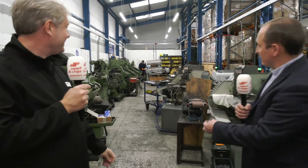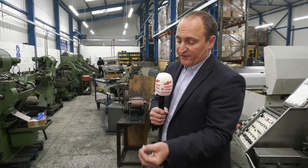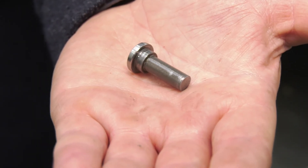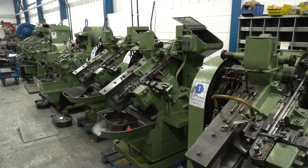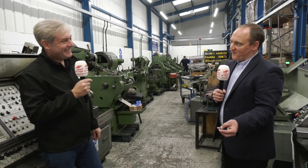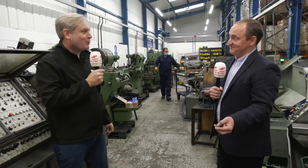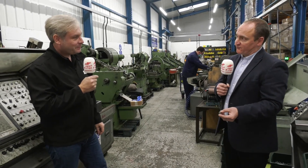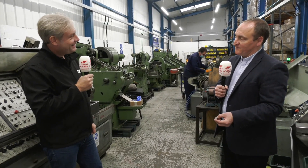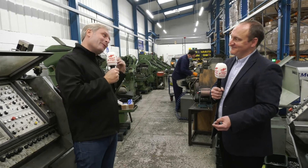So we've got machines down there which will automatically thread roll at quite a high speed and produce a knurl on the shoulder and a threaded shank. What do these date back to? The oldest thread roller we've got is a 1947 — they're Waterbury Farrell machines. Solid as a rock, not going anywhere, still holding tolerances. I mean, you put a thread on a screw in two or three seconds, which is actually quicker than most CNC machines will do it.